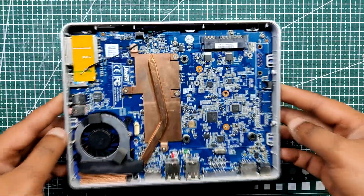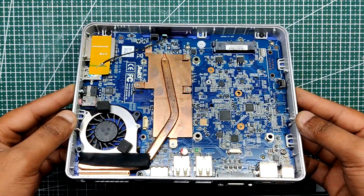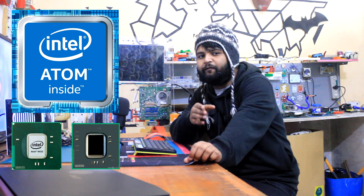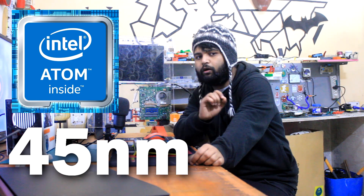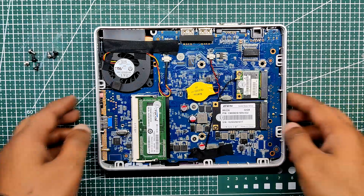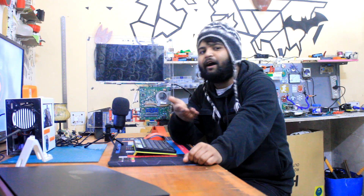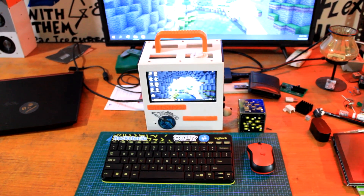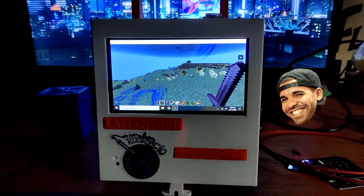I also have a small SBC with an Intel Atom N450 CPU — a single core processor with a TDP of 5.5W operating on a 45nm technology node — which was originally used to run software in an industrial press. It has 2GB DDR3 RAM and a 32GB M-SATA SSD, which is insufficient for running anything, and is another reason why I don't use this motherboard. I previously built a Macintosh-like computer using a Latte Panda 3 Delta single board computer with a 12th gen Intel Celeron processor, and it works so well that it can even run Minecraft. Do check that project out for more context.